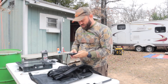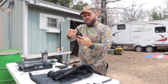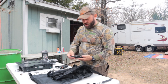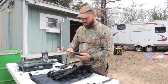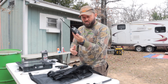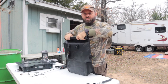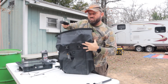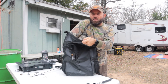Let's try another test. I'm going to go over to the NOAA weather station — this is 162.425. I've got this radio on receive for the NOAA weather station closest to me. I'm going to turn this radio all the way up, put it in the bag, and see how much it receives. This is a real far away signal, a lot farther than my HT standing next to me. As soon as I put it in the bag, it goes away — totally gone. I'm not even closing the top of the bag and it's gone.